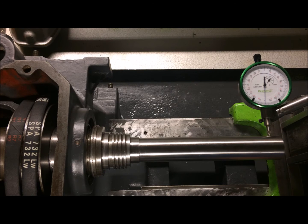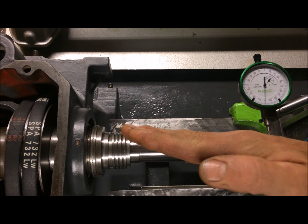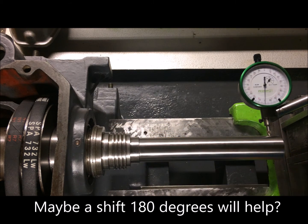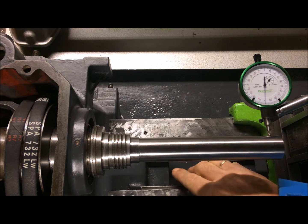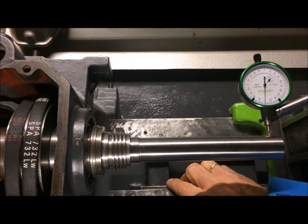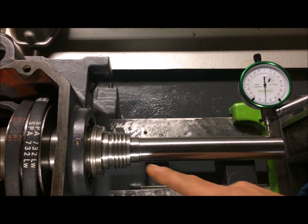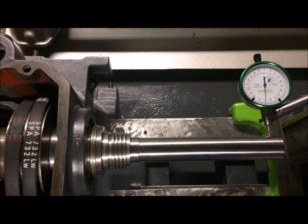It's seated a little bit like that. I'll try to reseat the bearing and the bearing houses again. I've tried to find out if I did something wrong with relining the bed strips - I doubt it, everything seems to measure up good. I think it's just the way it is. The taper being a little off - maybe I have to regrind it a little because it was rusty and I just polished it up. But all in all, as a hobby lathe, it's okay.